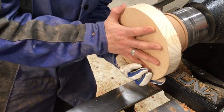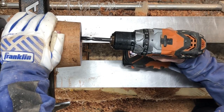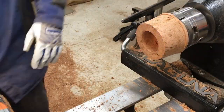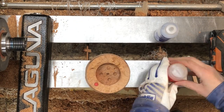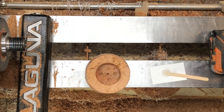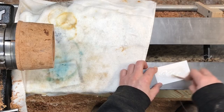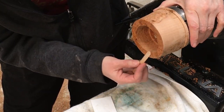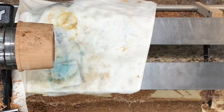I'm trying to get that face as flat as I can with my big sanding disc. I drilled some shallow holes in the bottom of this blank, and also a depression in the middle of it — you'll see why in a minute. I mixed up some five minute epoxy and I have some small rare earth magnets that I roughed up the surface with sandpaper and then I epoxied them into those four holes. Then I mixed up some more epoxy and glued the sections back together using the lines that I'd made to help line it up.